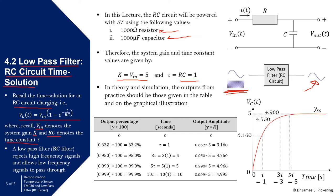In simulation, the outputs should look like this. One time constant is effectively equal to 63.2% of the final value of the system — in this case, since the output amplitude is the input times the gain of five, that's 3.16 volts. More usefully: at one time constant (1 second) you're at 63.2% of the final value, and at five time constants (5 seconds) you're at 99% and pretty much at steady state.